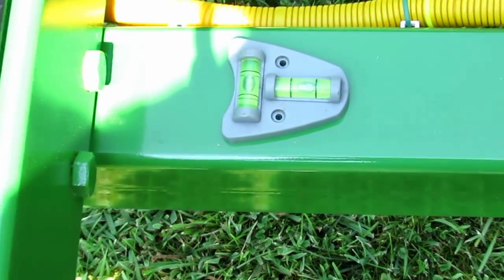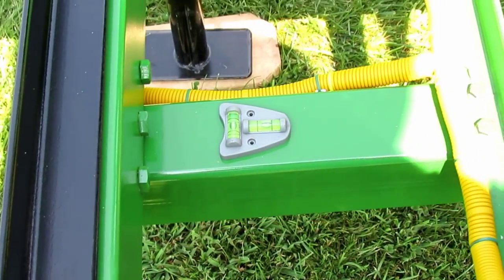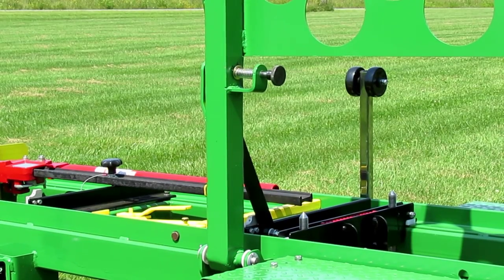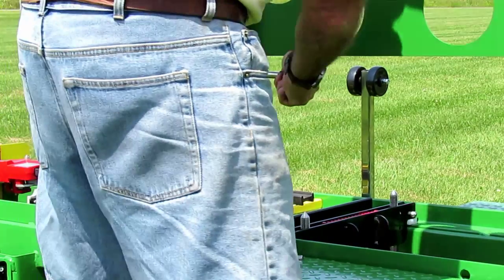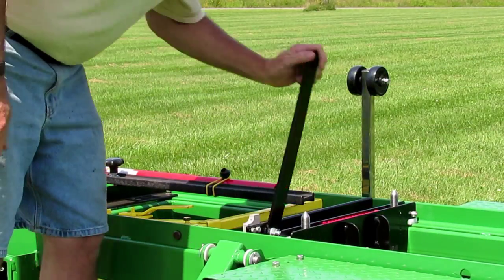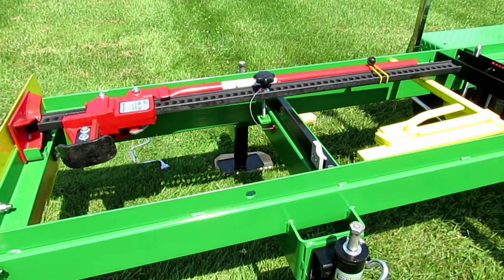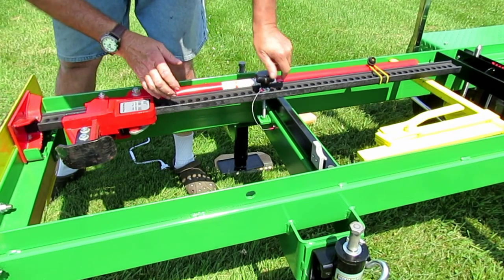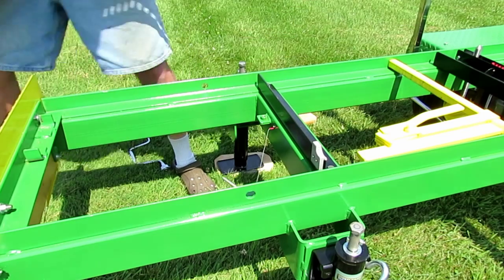When leveling, there is actually a little bubble level I place on the front tongue to help get everything leveled fairly well. I like to keep it going downhill to the back a little bit. Next, we take and drop the loading arm — just pull on the lever there and swing it down, then this part swings it back down out of the way. Then we just remove this screw so we can get the jack out to use it for the loader. Pull that in and it snaps right out of its bracket.